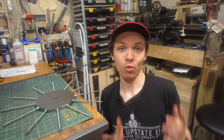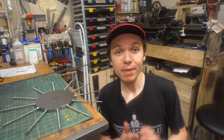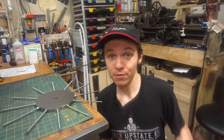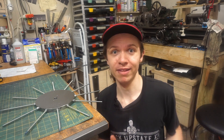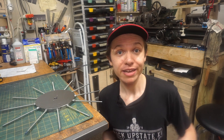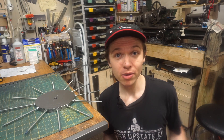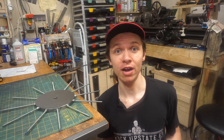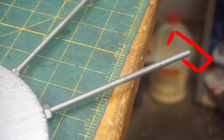The next part of the project is I need to somehow put a ring around the outside of the center hub that I've made. Ideally I'd like to make this out of steel or iron or some sort of really heavy metal. Moving the mass away from the center of the wheel will give the thing more momentum and that's really what I'm going for. But I don't really have the capability to machine parts of that magnitude in my shop. I've had to consider alternatives and what I've landed on is casting this ring out of cement. Cement is heavy, I can cast it in whatever shape and size I want, and it's also pretty cheap. What I'm thinking is at the end of each threaded rod I'll make a machined piece that'll sit on the end with threads in it, to help anchor the threaded rod into the concrete when I cast it.